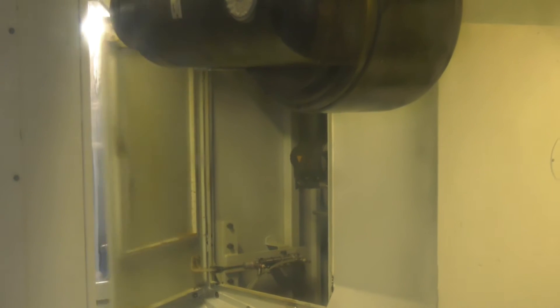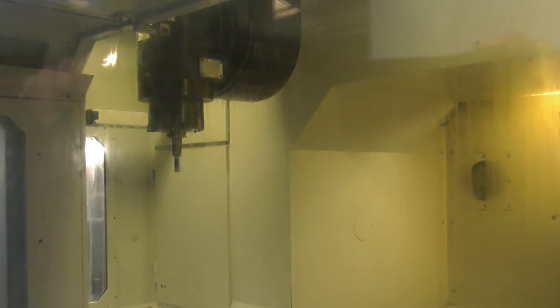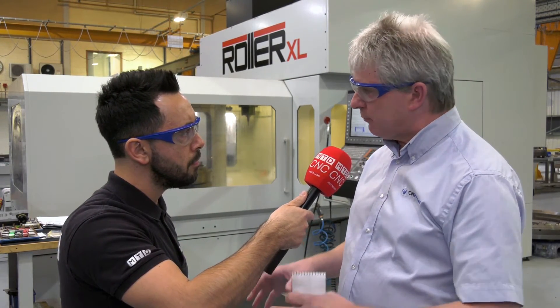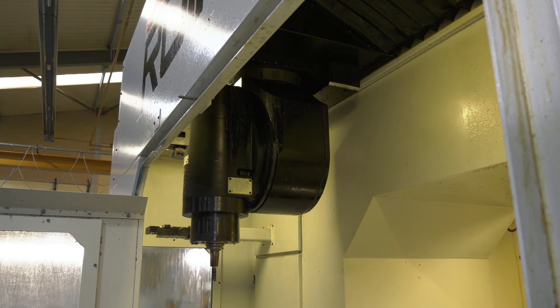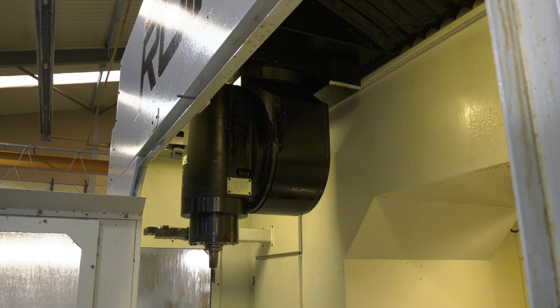That's correct, and what's really clever in the way this machine's been set up is it's primarily an A-axis tilting head — it tilts about the X-axis, which is the longest axis. The clever bit is when you rotate that head through an M-code, and the way the machine's been set up with the kinematic model inside, if you were to write code or a program for an A-axis machine, you rotate the head and internally it will do all the rotations — so you can use it as a virtual B-axis machine without changing any code at all.